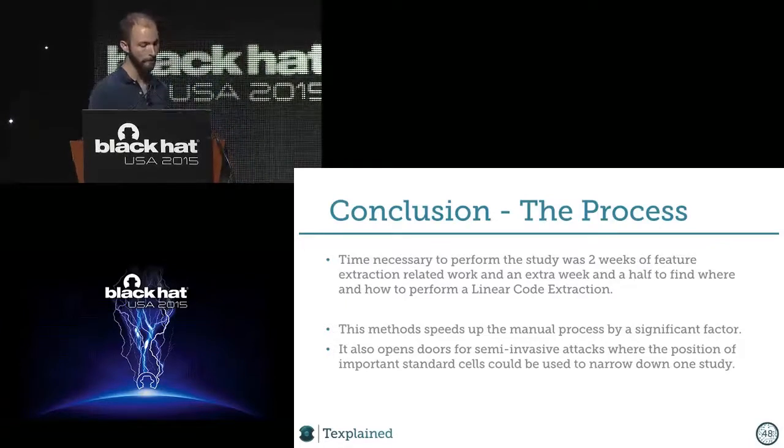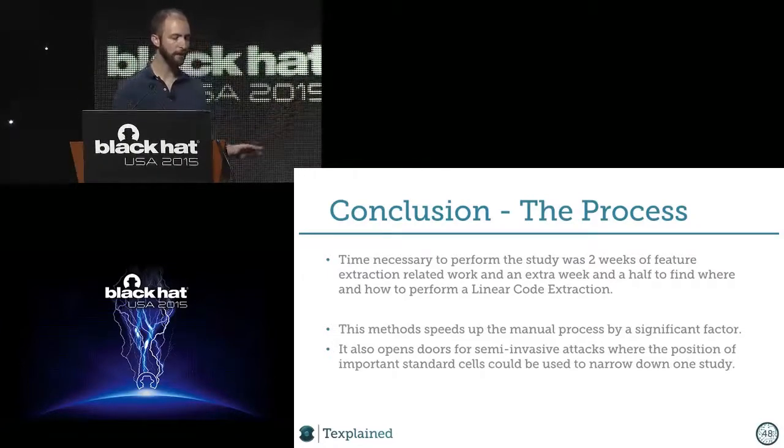It's huge. And this method is also opening doors. And this is something that for sure I will investigate later. For example, now we have a GDS2. And on my GDS2, I have a layer which is called active, and it's only the standard cells, you know. And now I can filter cells on the GDS2, for example, just to see registers or latches.